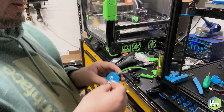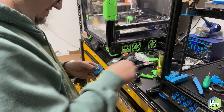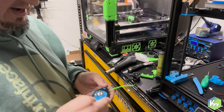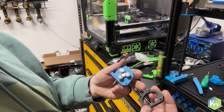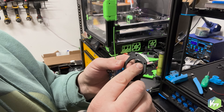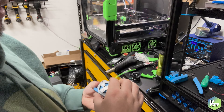Now the bearings I'm going to put in dry — very dry. Then I'm going to need the spacer that goes around the bearings. I want to make sure it's clocked correctly. There is a cutout in the back — you see that? This cutout is for this bolt down here. So make sure that is clocked correctly, then run that through and hold it in.